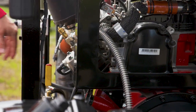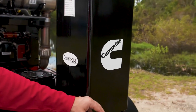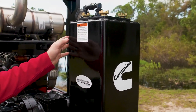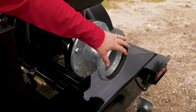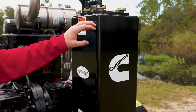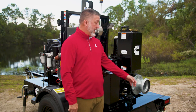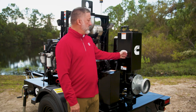It uses an air compressor to separate the air from the water, which keeps the venturi from clogging. An air compressor supplies air to a venturi providing powerful air suction to the chamber located at the pump inlet. The chamber empties air from the pump suction line, causing it to fill with water. When the suction line is fully primed, an internal float rises in the EnviroPrime system chamber, shutting off air suction. Compressed air delivered to the venturi creates an area of low pressure that evacuates air from the suction side of the pump, allowing atmospheric pressure to push water to the pump case. During operation, if prime is lost or air enters the suction line, the float will reactivate, applying suction to restore prime.